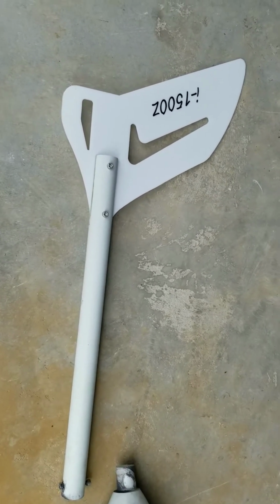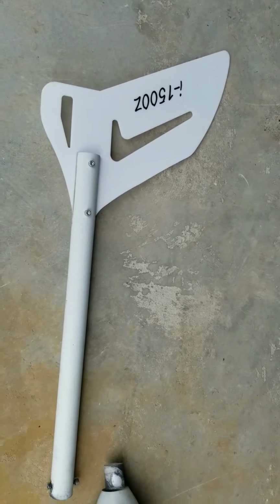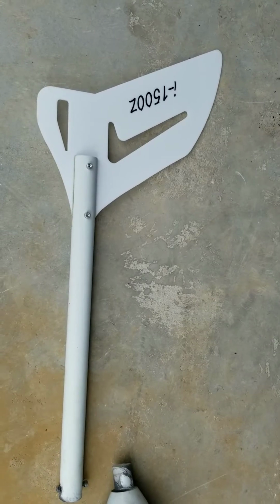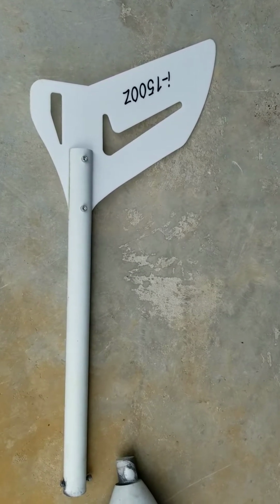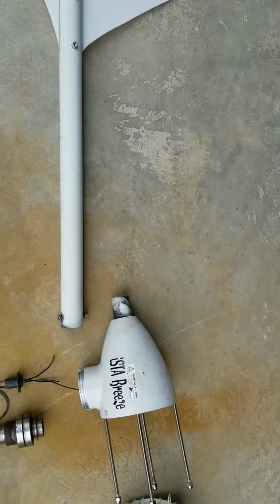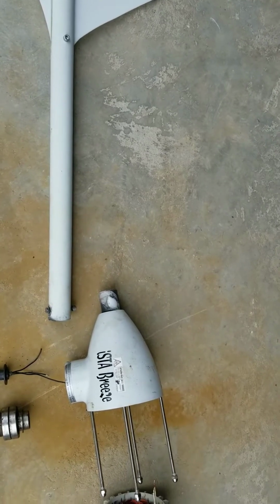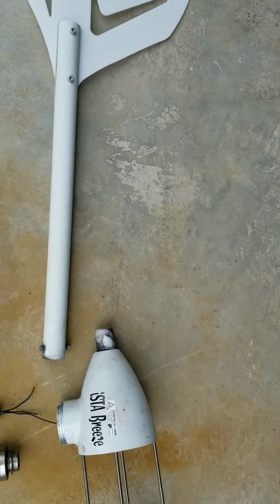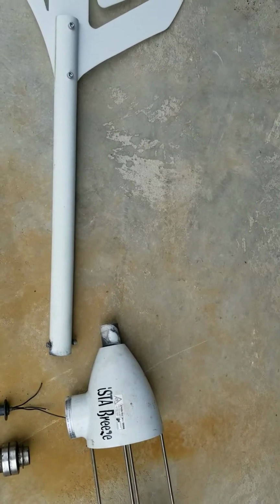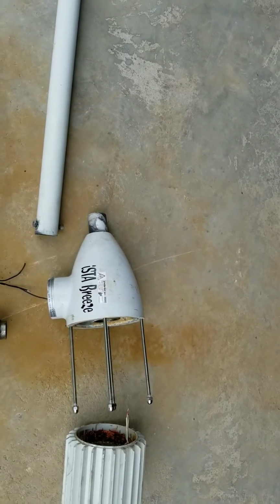It's too small. The turbine quite often will turn itself out of the wind because the surface area of the tail is not sufficient to counteract the thrust of the blades turning, and it will turn itself out of the wind just about the time it's producing some mediocre power and earning its keep. It will turn itself out of the wind, slow down, then turn back in and repeat this cycle over and over and over again. At least that is my experience. And I have it up 60 feet in a relatively clear spot.